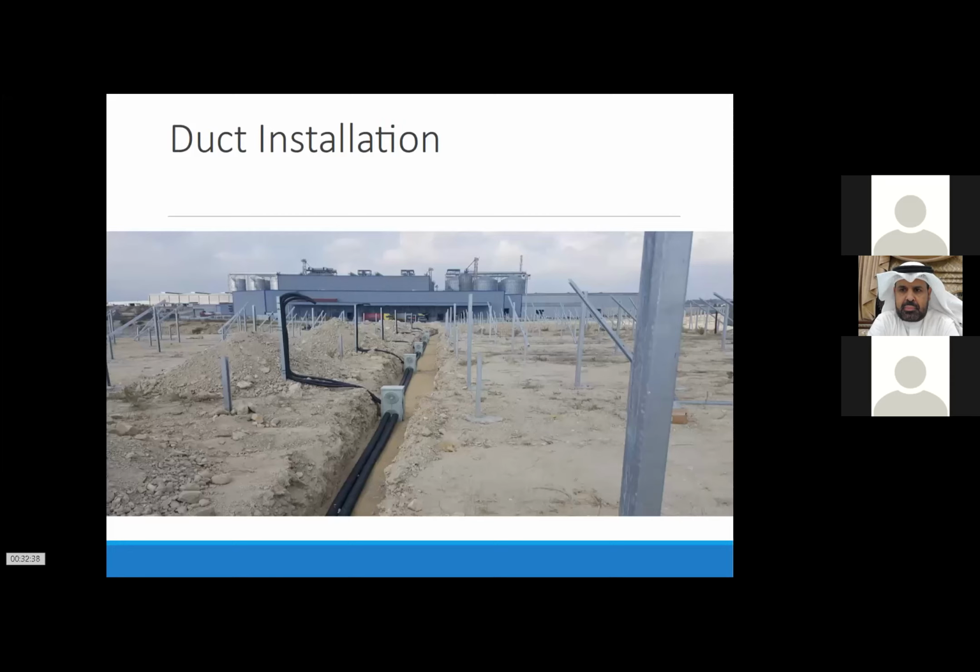What they do in hybrid mode is they actually engage the neutral and the earth inside the inverter when the power shuts off or when they're in island mode. That means if you're in hybrid mode running with a grid system and then running on an island, you combine the neutral to the earth. But it depends on the manufacturer. Normally you should earth the system somehow, because otherwise you have a floating voltage.